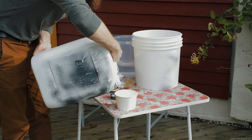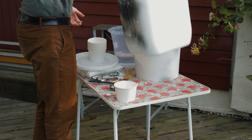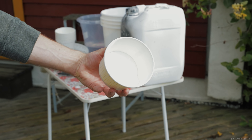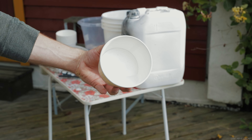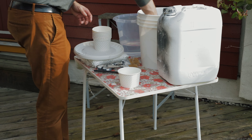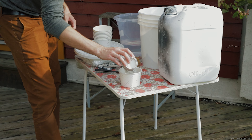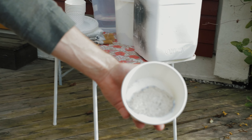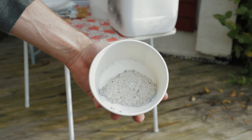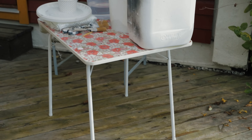Work time does change because of this. I find that I get around 30 to 45 minutes working time when mixing the resin to a thickness like the one you'll see me mix it to here. It's the thickness I prefer when applying the material into the mold — kind of like a peanut butter or Nutella chocolate spread type of thickness, for those of you who are familiar with what those are. I'll get into the reasons for what thickness I mix the material to in a little bit.